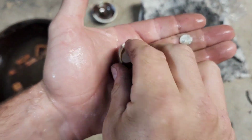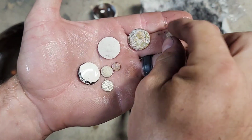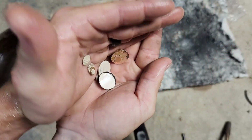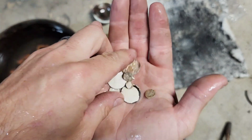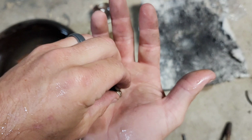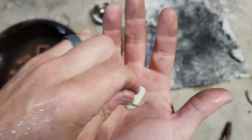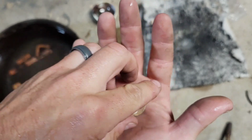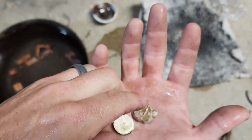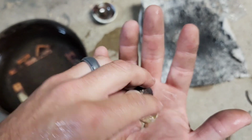And there we are. Look at that. Beautiful contacts. Well, let's go rinse these off with some distilled water because I just dumped them in tap water. Let's get a weight on it and throw these bad boys in nitric. We can cement it out, get a weight, see what the percentage is of silver, along with knowing if they're silver plated or silver all the way through.